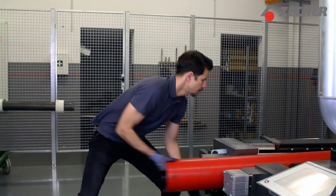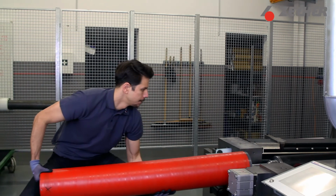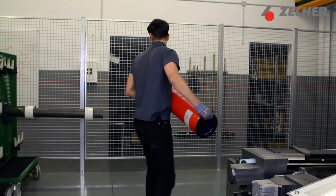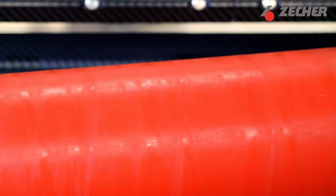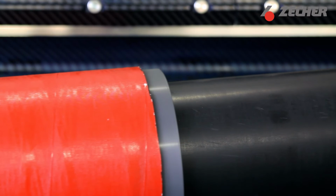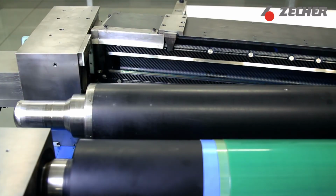When you pull off the sleeve, make sure it remains horizontal to the air mandrel, so as to avoid any leverage on the sleeve at the end of the air mandrel. Sudden interruptions during the dismounting process may cause the air cushion to collapse, as not all air holes are sustaining the air cushion anymore. This is especially true for the final section of the mandrel, because then only the front holes create the air cushion. This can get the sleeve stuck and makes it more difficult to remove it. As a result, there is an increased risk of damage to the Anilox roller.